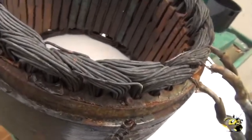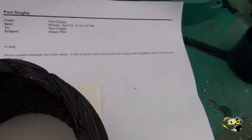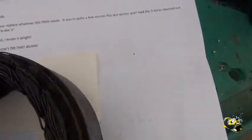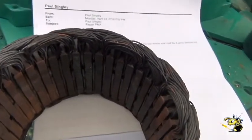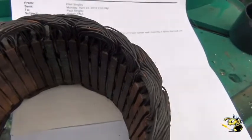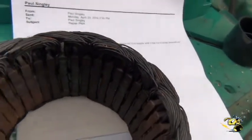This is what happens: your wires superheat and they turn into charcoal. You've got to let these freewheel or at least have them under some kind of load during a storm. Or if you have a really big turbine, it needs to have a furling tail or something. If the high speed starts bending your pole, you need to get a furling kit from us to slow it down a little.